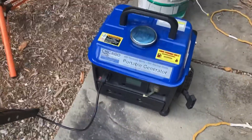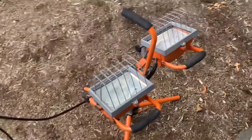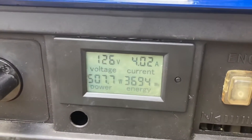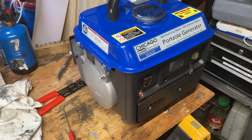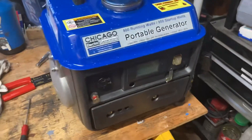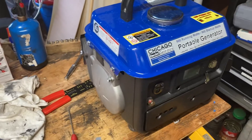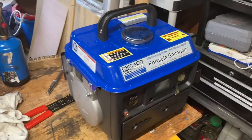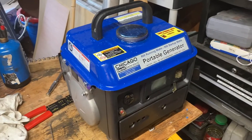Today is tomorrow and I've got the generator put back together and ready for a quick test. The setup is: generator to my test set with the new meter in it, and over to a 500-watt incandescent or halogen light. There you have it everyone - resounding success! Both meters seem to be working well and they both matched up on their measurements. I think this is a great little accessory for a generator. I'm thinking about doing this on my larger 5-kilowatt generator, though the issue is it has a 240-volt line split into two 120-volt lines, so I'll have to think about how to install one economically to monitor the entire system power. But that's a project for another video - thank you all for watching, I hope you learned something and this will inspire you to tackle this on your own generators.